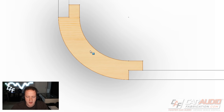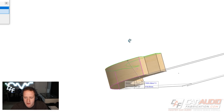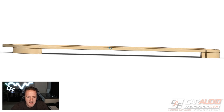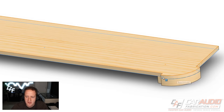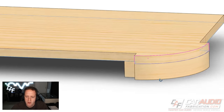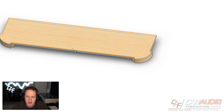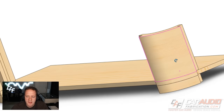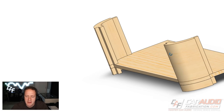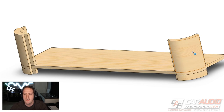These are the first two layers, modeled at an inch and a half thick — two layers of three-quarter inch material. The next layer to model was the baffle. Using that same initial sketch, I factored in the same quick-corner profile shape, but the baffle also sinks in to each side to allow clearance for the front and sides. Next, I model up the rest of the stack for these quick corners, going far higher than actually needed for the front of the box, since we'll come back and trim with a slice later.